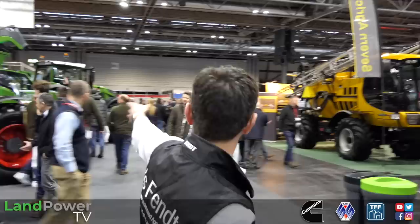Let's start at the front. We've got an all-new AGCO Power engine - the Core 75 engine. This has been seven years in development. It's a less complex engine - compared to the Deutz. Where it loses the complexity is because it's been designed to be a Stage 5 engine from the get-go. It's not where you just keep adding all the bits and pieces.